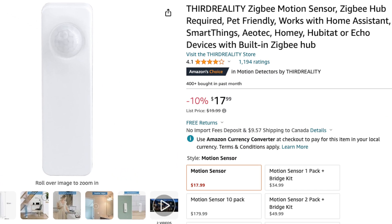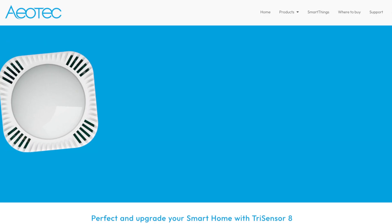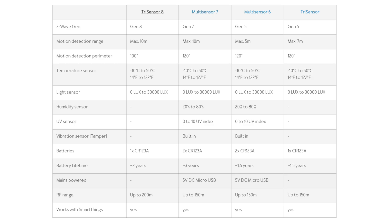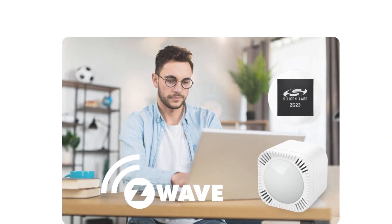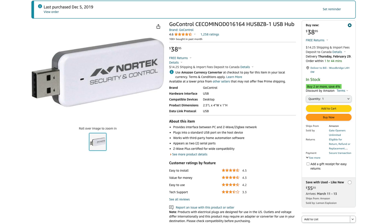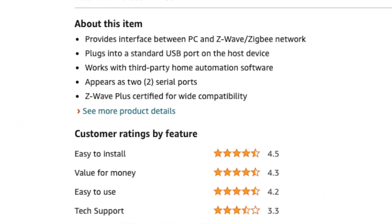There are many many different versions. Be aware you can find cheap ones and modestly priced ones — often you're going to get what you pay for in terms of reliability. Around 50 to 80 bucks is a good average price depending on the number of sensors included. My favorite is the Aeotec multisensor. Depending on the model, this device has up to seven sensors built in. It comes in a small form factor with the option to run on batteries or be plugged in. It's a Z-Wave device, which means you'll need a Z-Wave receiver. I use a simple USB dongle that provides both Z-Wave and Zigbee — two popular protocols for smart home devices. I'll put the link below to the one I use.